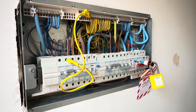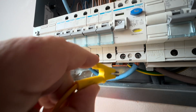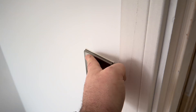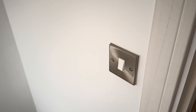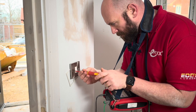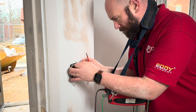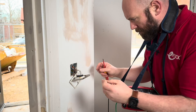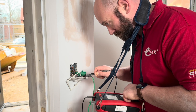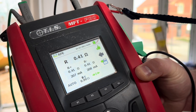I'm carrying out test method one on this lighting circuit. I've linked out the bus bar as the electrician has made the connection, so I won't be interfering with his terminations. I also go to each switch to test that the protective conductor is at that point. It is also to ensure that where metal accessories are used, the exposed conductive part is earthed via the CPC. Even on plastic switches, we have to consider the protection as the 3.5mm screws are sometimes connected to a metal back box, which is an exposed conductive part and can be easily accessed.